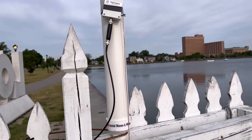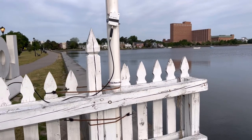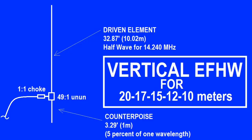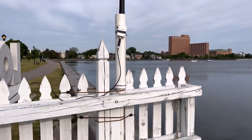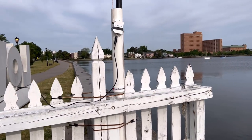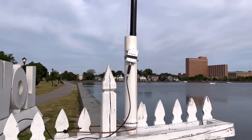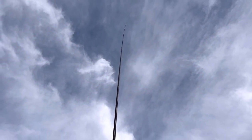What I do is put a 1-meter-long wire, which is 5% of a wavelength, as a counterpoise. So I've got basically a little over 10-meter driven element, then down with a choke. So instead of the antenna trying to use the coax as a counterpoise, that 5% of a wavelength will work as the counterpoise. There will be some debate on this in the comments, but I've done this before and there's a lot of info out there — that's the way I do it. So there it is, the 1-meter-long counterpoise wire, all going up on my DX Commander 10-meter pole.